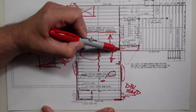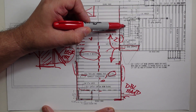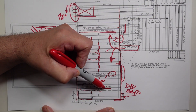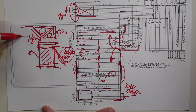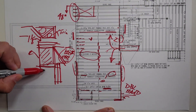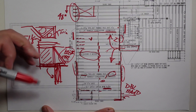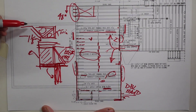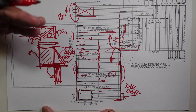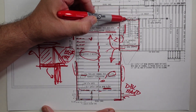We have some incidental framing here, but we're going to talk about that next week with the double band video. You can see all the LVLs that get called out — we get the size, inch and three quarter by eleven and seven eighths, the quantity, and most importantly the location. What I use are two terms: either dropped or flush. Flush means the LVL is in the same plane as my truss. Dropped means the LVL is below the bottom plane of the floor joists, carrying from below without any joist hangers. With flush, you need joist hangers to hang the floor off that flush condition.